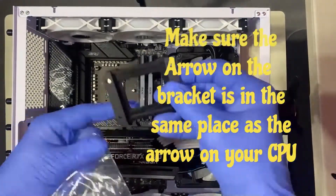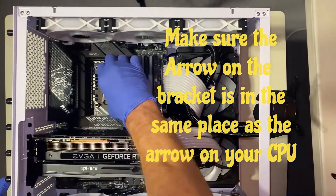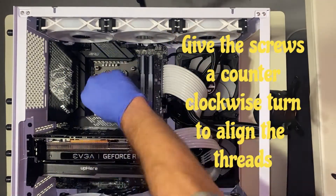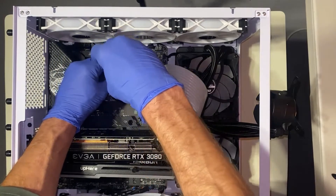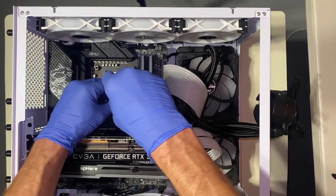I like to walk them down — you don't want to run any screw down all the way. You want to just run it down a few threads, go to the next one, preferably cross from it, then a few threads, and keep doing that until you're all the way down. You don't want to torque it, you just want to go tight, but you do want to be tight.